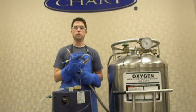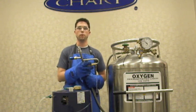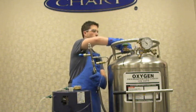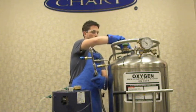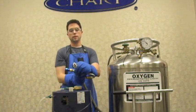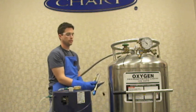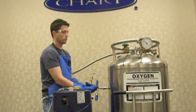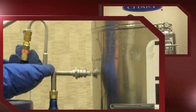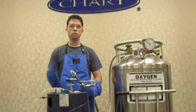One last step to preventing moisture infiltration is to purge your transfer line. This will be the last thing you do before you start filling. At this point, go ahead and turn on your liquid valve on your source tank. The easiest way to purge the transfer line is to take your side fill, pop it against the side of the tank, and depress it until you see liquid start to spray out. Alright, so we've got all the moisture off, our Liberator ready to go, and our source tank ready to go.